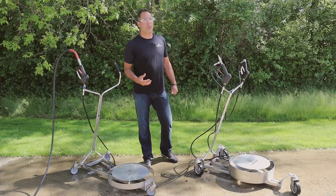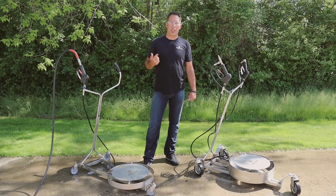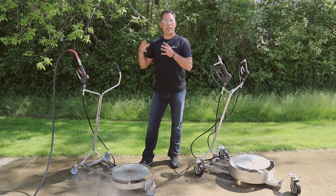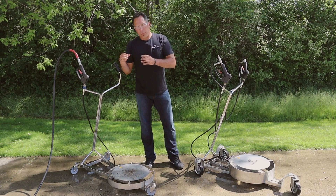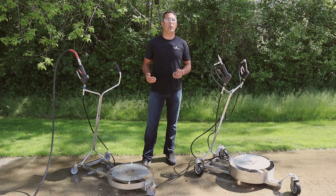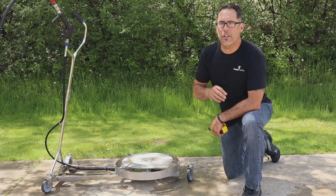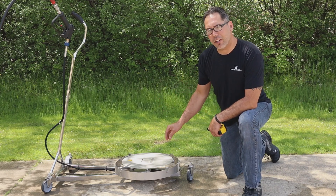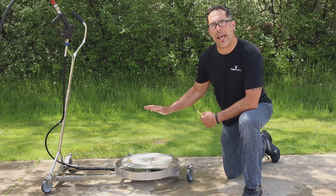Before we get started with the demonstrations, we want to stress safety. Jordan and I are both wearing eye protection — not just because of the water stream but because of all the loose debris that's going to come off the chassis, getting flung up by the spray arms, and also to protect the unit from debris causing premature damage. Safety is always a number one concern when using any high-pressure equipment. We're using a 3,500 PSI machine with 4 gallons per minute on a Hurricane standard, using the factory number 3 tips, just to show you what that impact height is going to be.